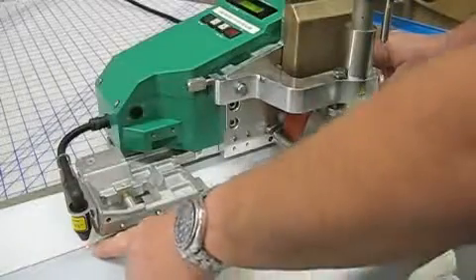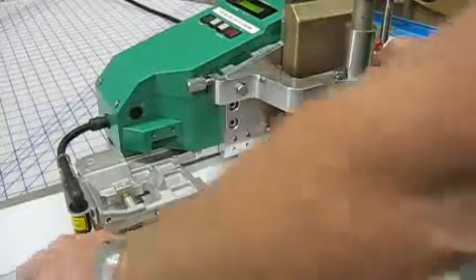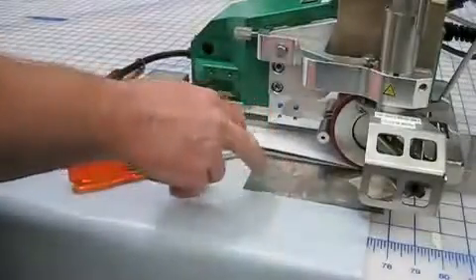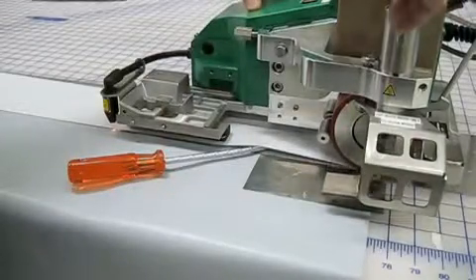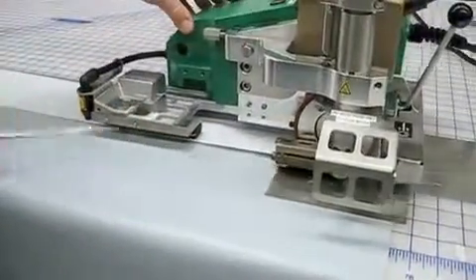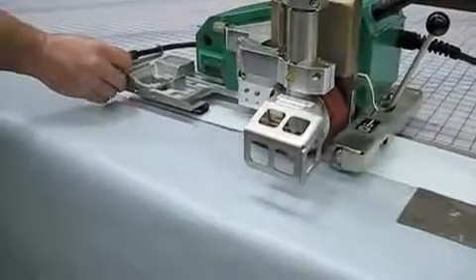Once we go, we're going to use our laser to keep us on track, and that'll be right on the edge of the pole pocket. We have our flashing in place so as we introduce the wedge, we won't burn the material. We do have to start the machine prior to inserting the wedge so it won't melt it. Now we use the laser to keep us on track.